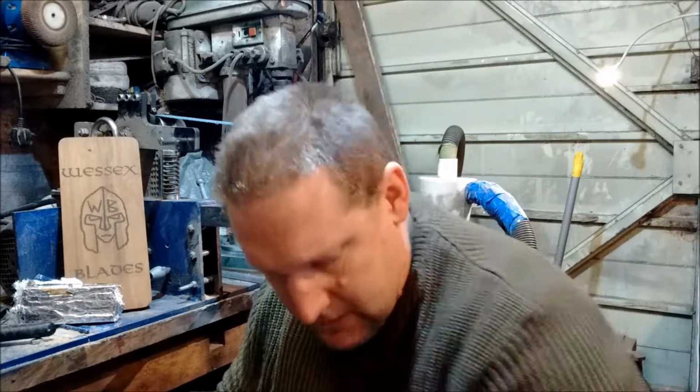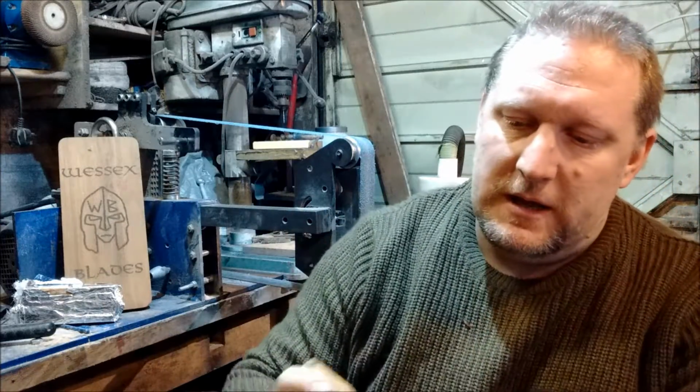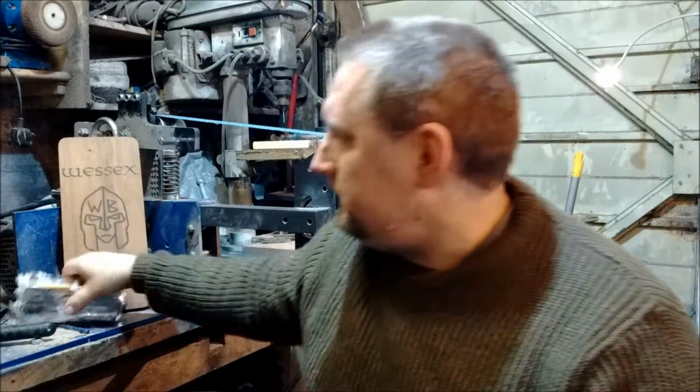I dare say all the people looking at this now with their knives on order are getting quite excited. I say this here is before it's even finished and sanded down to a higher degree, because now it's plastic impregnated. It can be finished right up to micro mesh, which is a series of abrasives that's beyond 1500. You can go right up to 12,000 with micro mesh. And you can be quite rough with it when you put it in, whereas if you had spalted wood unstabilised, I wouldn't be throwing it around because you could actually dent it.